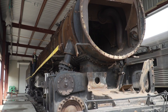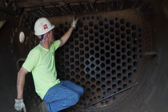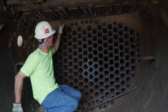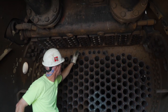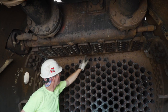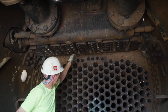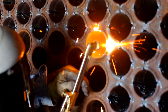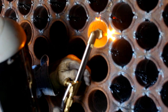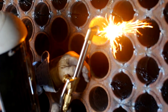The reason for the flues having a larger diameter is this manifold above me — there were basically smaller bundles of pipes that connected into all these different joint surfaces. That pipe carried steam directly from the boiler. That steam was essentially wet steam coming directly from the boiler, which would pass through and go down through this bundle of pipes called superheater units.